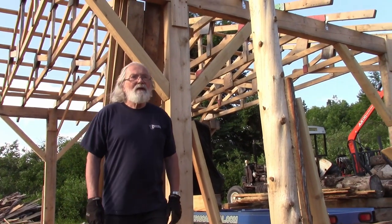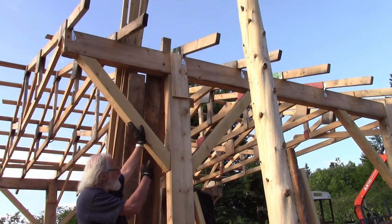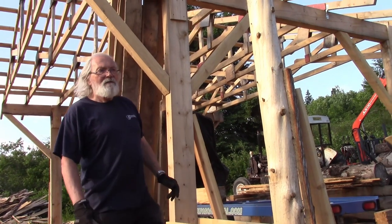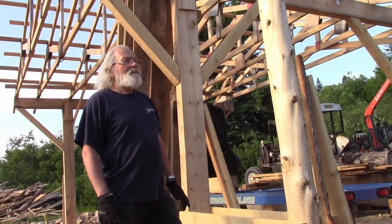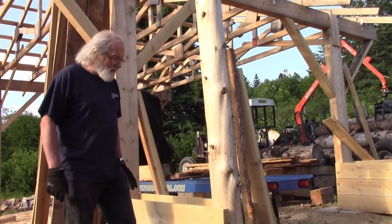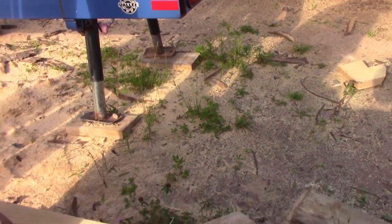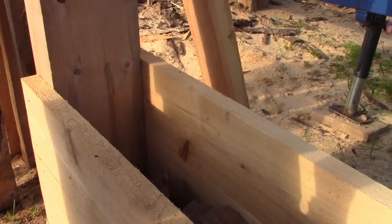For those who may not know this, these cross braces on either side, they are new. They've been added, yeah. We have temporary 2x4 ones. These are some 4x4s that I milled up out of cedar. So that's done. The post is now installed, and I built this kind of retainer hollow wall, roughly 3/4 or so full of rock. Okay, so you're filling it up.